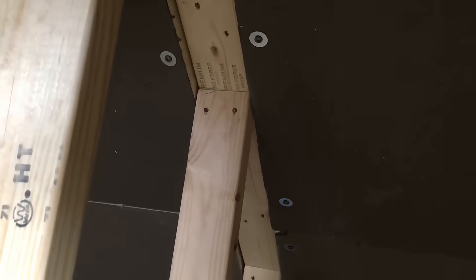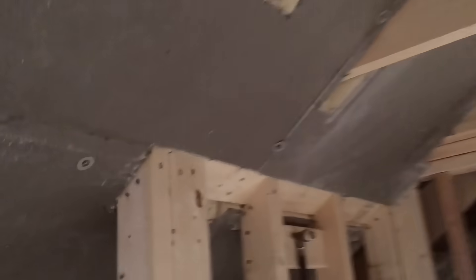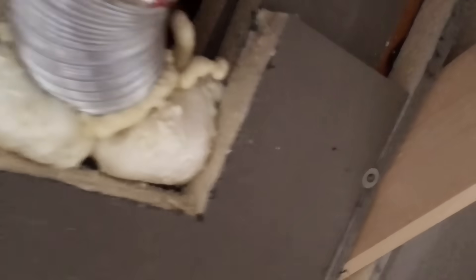Now I've gone back and got all three layers of insulation installed. Then we're ready to go back and foam and see how we work around these top plates, cut around all the collar ties. This is the bathroom shower area — very careful fitment. And then we're going to come back in and foam all these cracks everywhere, all the gaps, with Great Stuff or some other polyurethane foam variant.